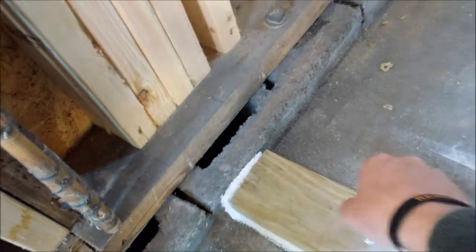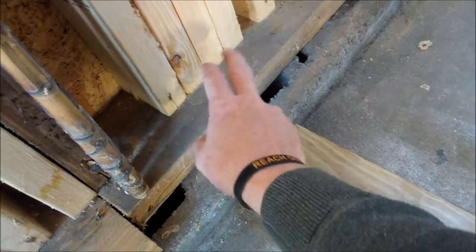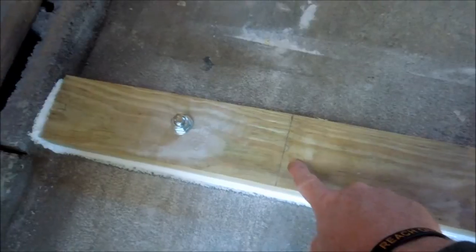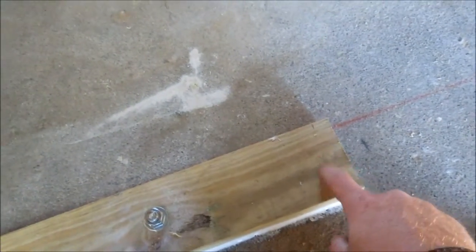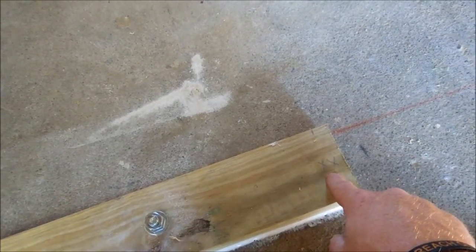And when I'm pulling on centers, I'm pulling from the corner, but I'm going to go ahead and throw one in here. So one here, I've got it marked with an X, and then one here on center. That's going to be my 16-inch center mark. And I'm going to put two out here next to where my door casing is going to be, or my rough end for my door.